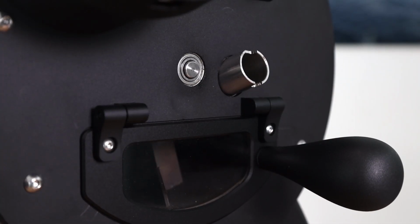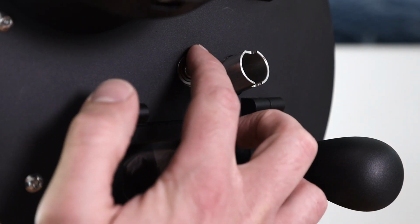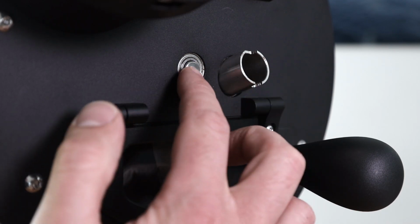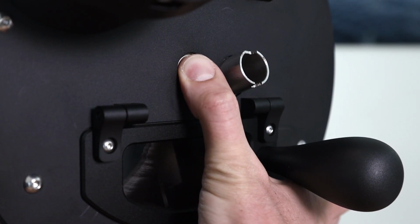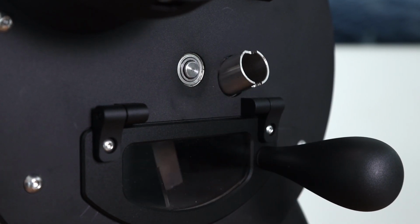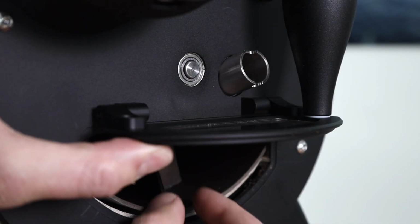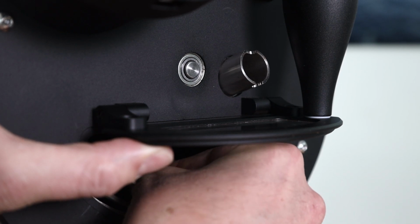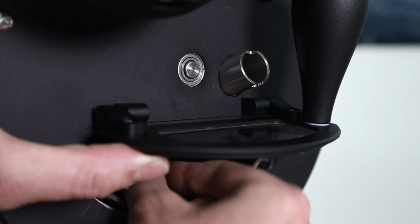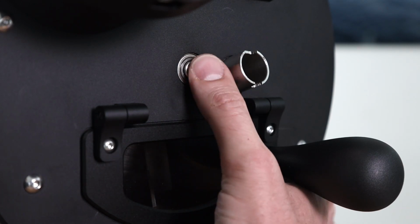When you receive your roaster, there are a few things that you have to check if everything is in perfect order. So one is the drum alignment. You can see here actually the axis, and you can see it's coming in front for about 1 millimeter. You can press it here and the whole thing has to move a little bit, also about 1 millimeter to the back, but then being put back in position in the front. If this is not working, then you open the drum here, you turn the drum until you come to this metal part which is diagonal so that you can pull it. You hold it here and you pull the drum a little bit so that it's coming in front in place. And in 9 out of 10 cases now the drum should be in perfect position.